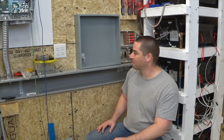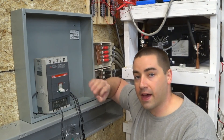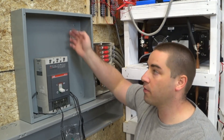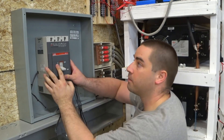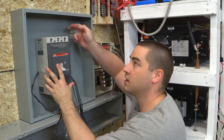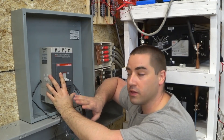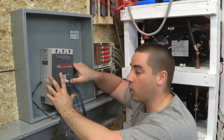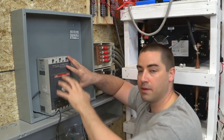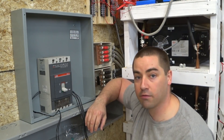The wires I'm using are 2-aught wire gauge, so they're big fat cables and they need a radius to bend. I can't have this mounted way up high because I don't have enough clearance to bend that cable. I do have flexible wire that I bought for this purpose, but it wouldn't be to code — I have to maintain a certain wire bend distance. So I'm going to mount the ABB breaker lower to give myself more room to make that radius.